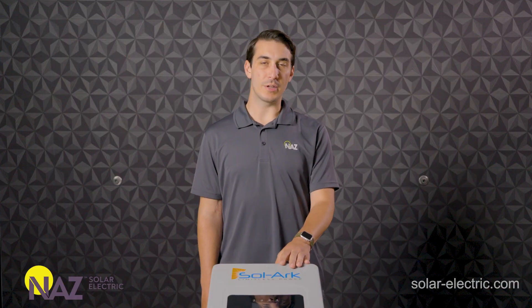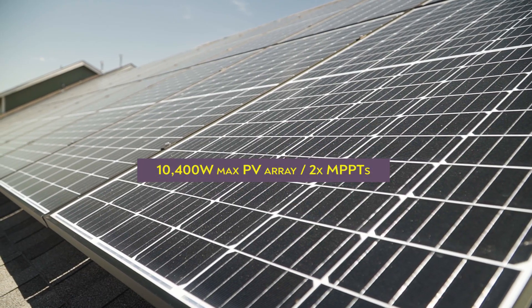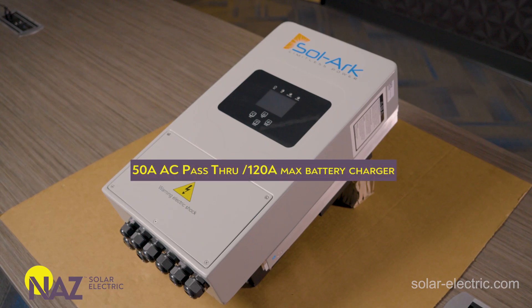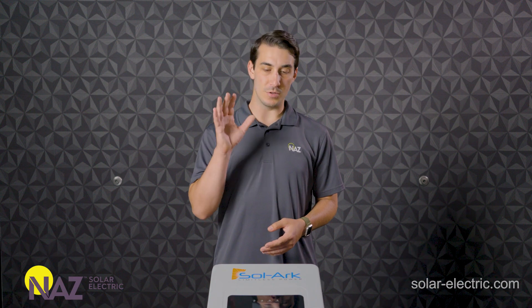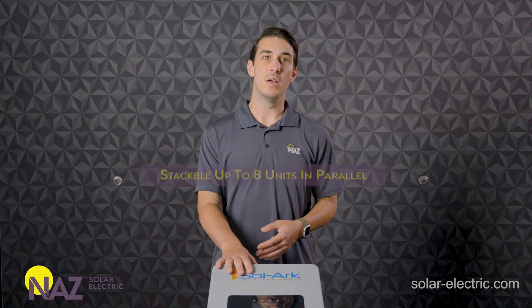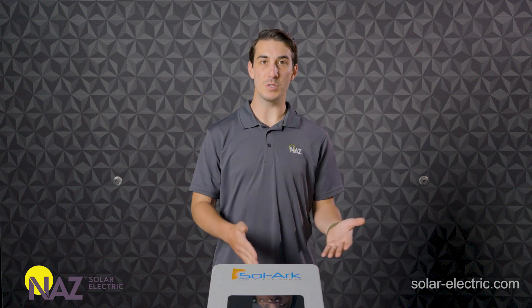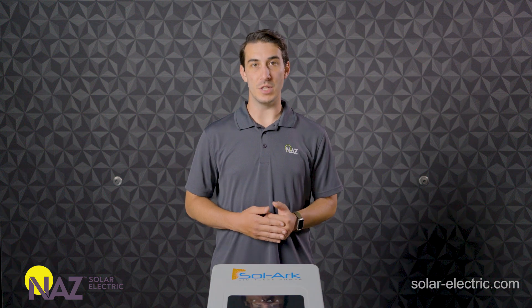This model from Solark is capable of handling a 10,400-watt maximum size solar array. It does have two independent MPPT trackers. The unit has a 50-amp rated AC pass-through and a 120-amp DC battery charger. These are also stackable — you can have up to 8 units in parallel. Parallel means increased power output at 120 volts, not necessarily split phase, but you can add multiples of these in a common installation if you need to.